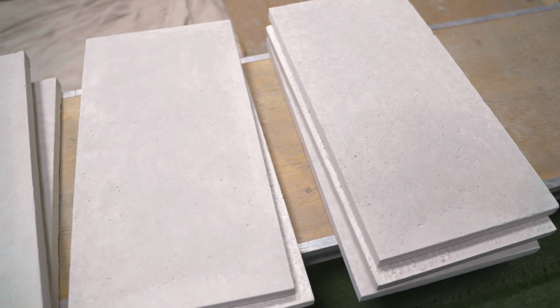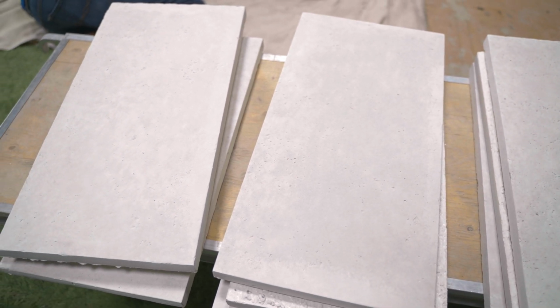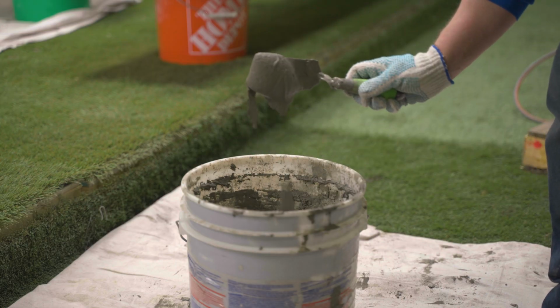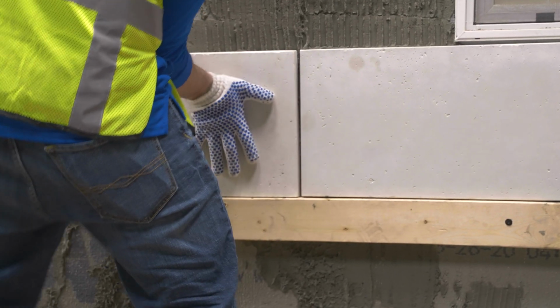A large stone unit is defined by NCMA as a stone with greater than 1 square foot area, or one dimension 24 inches or greater, that requires additional skill and attention. Large format stone units provide the installer with a couple challenges related to wall preparation and setting the units. These units can be more challenging to install than conventional units. Proper bonding materials and techniques are essential. A key to good bond is achieving a full setting bed of quality mortar with ample squeeze-out.